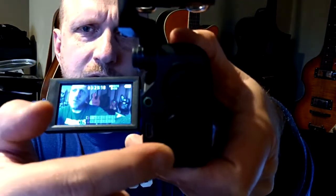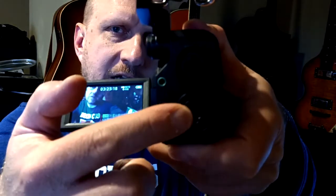So in addition to the stereo left-right mic, you also have on the back these two separate direct inputs, which can be either XLR mic or quarter inch line level. You need to arm them here by pressing these soft buttons 1 and 2 for inputs 1 and 2. And here are the wheels to control their input levels. Similarly, just put it healthy in the green. You do need to change a couple things in the settings to make this work.